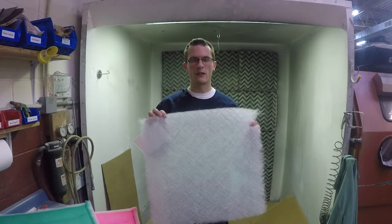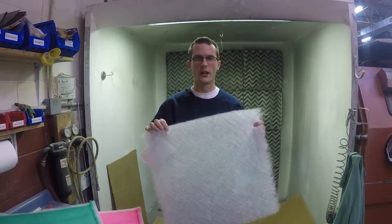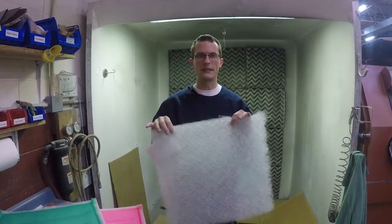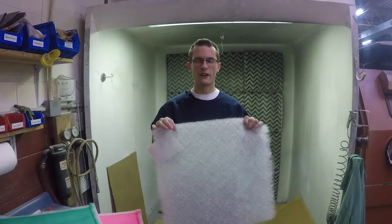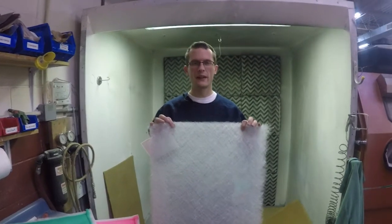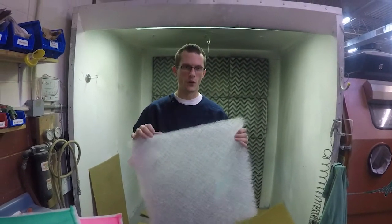That can be a way to have strong performance but at a little bit of a lower cost than if you just go with strictly a 1-stage top of the line filter. The pockets are expensive initially. They can be a $4 to $5 per pocket expense, but by layering it with a very low cost sacrificial first layer or blanket, you can keep the overall filter system cost down, but increase the performance.